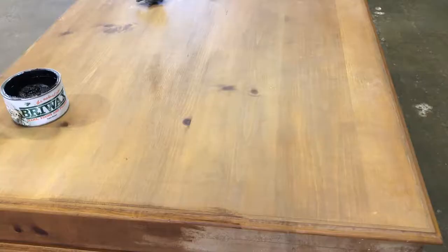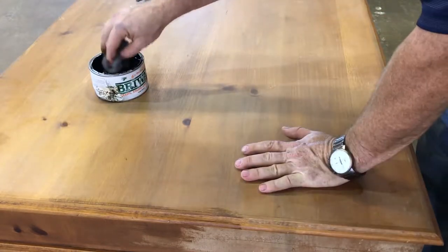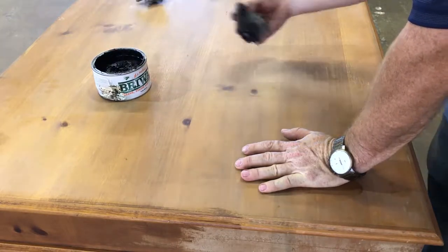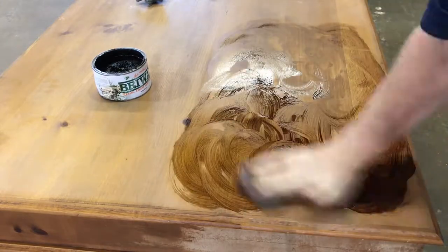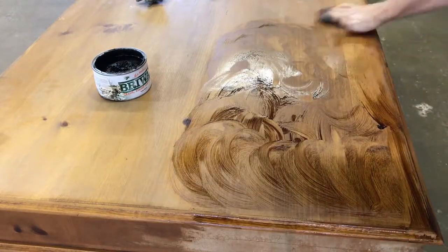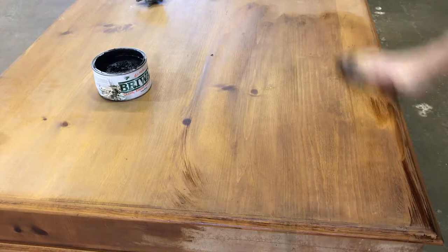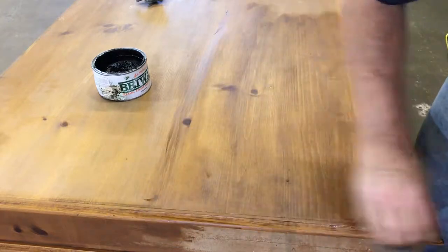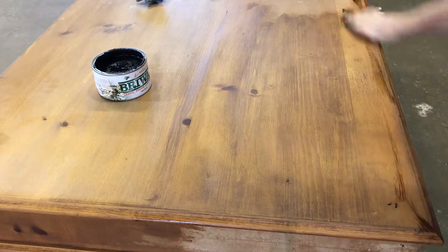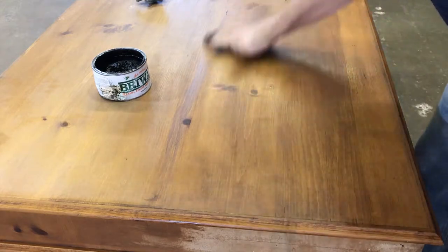The finish may be a little coarse, might have a little bit of grit or dust on there, so that's why I'm using the 4-0 steel wool. I usually use that when I'm trying to redo a finish. This top is three foot by six foot, so I'll take about a foot and a half by two foot, start with circular motions, rub that wax really well into the grain, then finish going in the direction of the grain, rubbing off any excess. Don't want to overdo it.